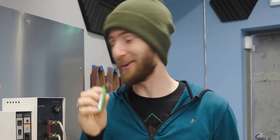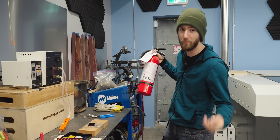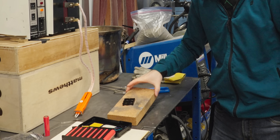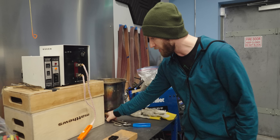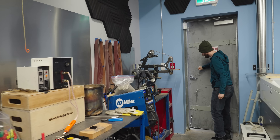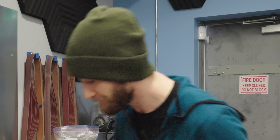Before we begin, let's talk safety precautions. We've got our fire extinguisher, though that's unlikely to do much with a lithium fire. So we've also got a fire safe workstation with a fire brick for our actual welding, gloves and tongs in case we need to handle a ruptured cell, a sand bucket with additional sand to dump over it, our fume hood, and a pre-propped door so we can take that sand bucket outside in the event we need to get rid of it.